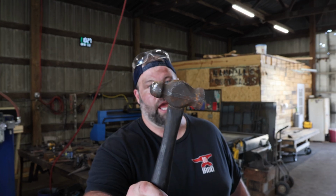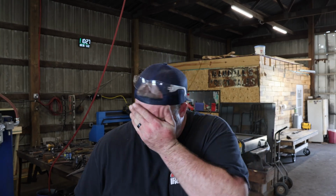For my next act, we'll need a ball peen hammer, a bob punch, and we're going to use a swage block. If you don't have a swage block at home, drill out a hole in a stump and burn it with the round end of a fat piece of metal that's going to fit that. Be the can-do person. It's really easy workarounds. A lot of people have stumps, and they're actually pretty cool, and you get a lot of use out of them. You kind of figure out what you need.